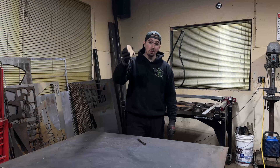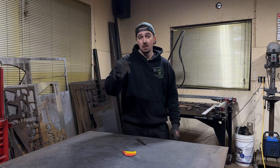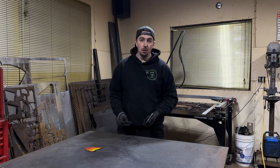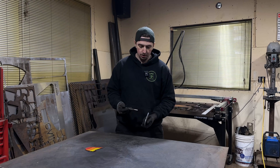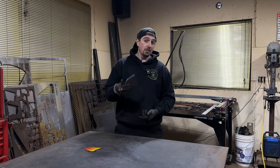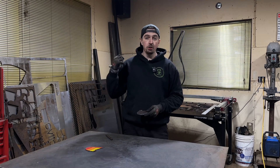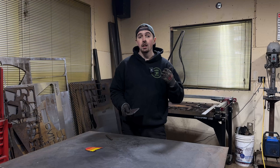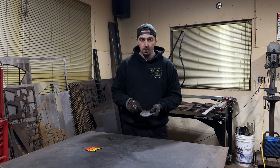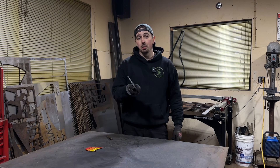Just like that, we go from our chunk of cardboard to our actual piece of metal for our suspension mount. After using a CNC plasma cutter, you're going to have some chunks of slag — that's what you saw me chipping off the sides. One of the worst-performing cuts happened because halfway through, my consumable blew out through the side, destroying it. I had to replace it and run the cut a second time, which left significant slag since that first pass didn't go all the way through.